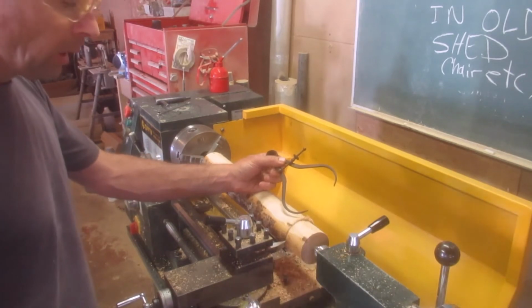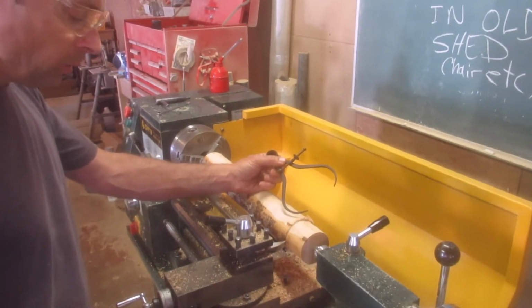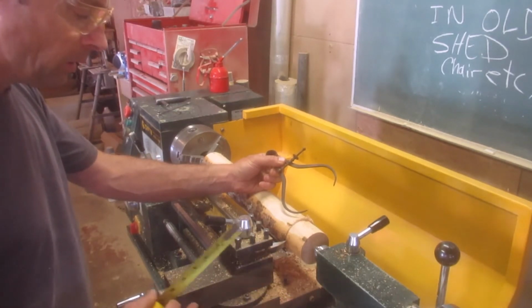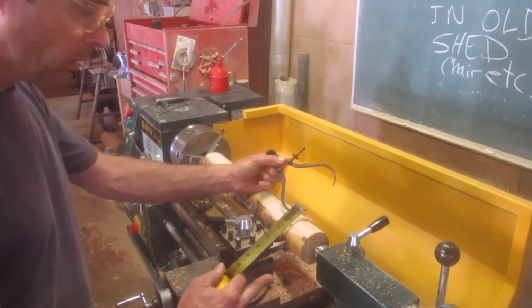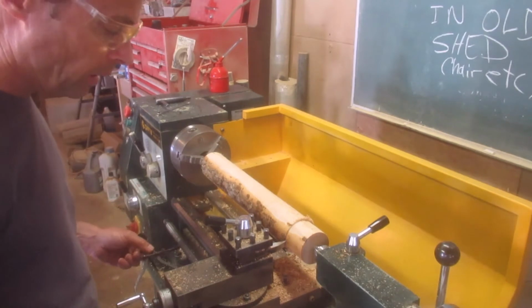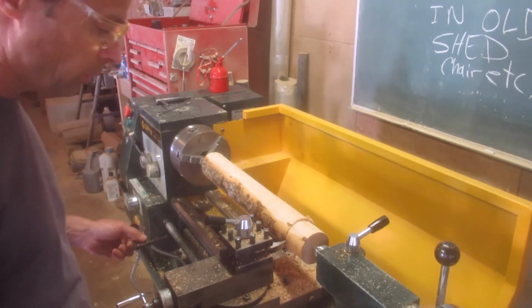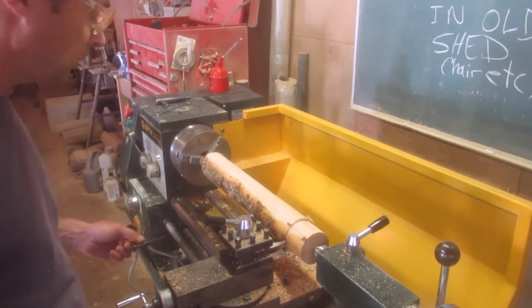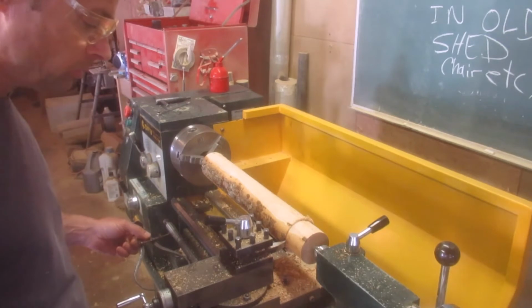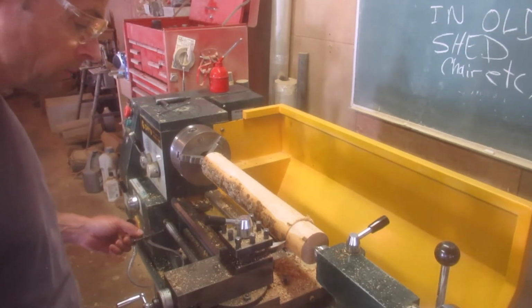Okay. I thought that I could lock my lock nut and engage the feed that way, so that way I could have cut a taper on either end, but I can't do it on this lathe. They won't let you lock this and this at the same time. That's my threading lock, the lock nut to the lead screw. And this is my feed.